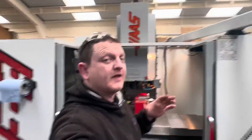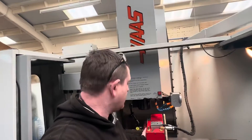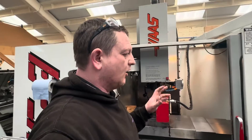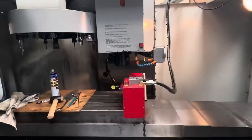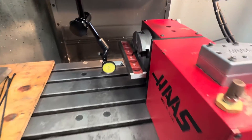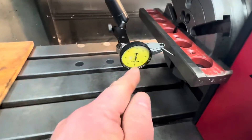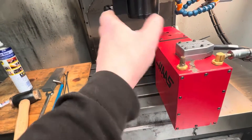That's as good as I'm going to get the fourth axis — the face of the fourth axis on the table. We've pulled down tight. We've got the bolts nice and tight so that won't move. And we are as good in Y and as good in Z as we are ever going to get. I've never done it to that precise alignment before. I've always just, for the little parts I do that are maybe like an inch and a half, two inches long, I just slap it on there and bolt it down, using the key, and that's fine. So this is a good way. Cable tying that parallel through there actually works really well, so you don't have to keep going over those bumps — everybody knows if you use the indicator and go over them too quickly, you can jump the indicator a little bit and it won't go back to where it was. So that's as good as we're going to get.